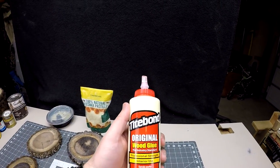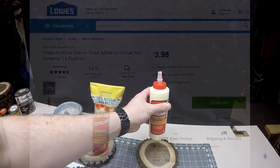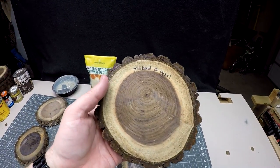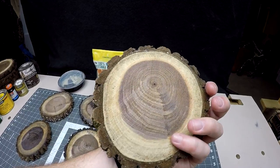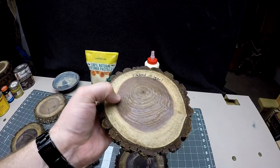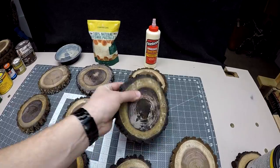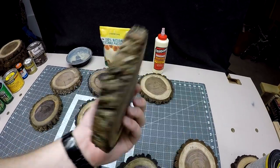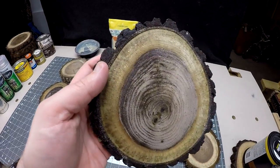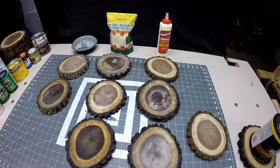The next thing that works is Titebond Original Glue. Why Titebond Original versus Titebond II? Titebond II typically leaves the glue a little bit yellow; this one dries clear. As you can see it looks really good — no cracks or checks — though it leaves it a little bit rough compared to beeswax, which left it softer. All these Titebond pieces look great; you can always come back and sand them if you wish. I used a silicone brush to apply it and it did a really nice job.